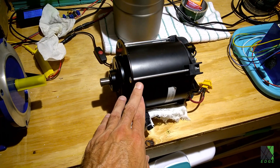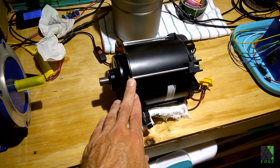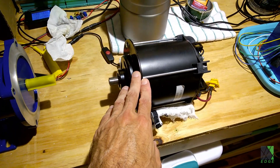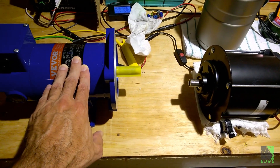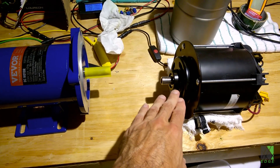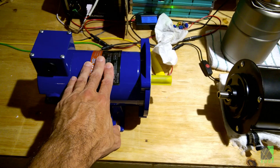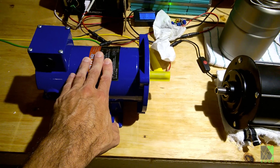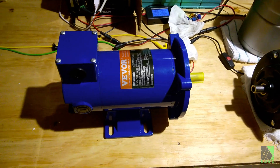This one is a half-horsepower motor. I did do a brief bench test and it jumped up and nearly landed on my feet on the concrete floor — thank god that didn't happen. This is a very powerful motor, and so is this one. What I could do — this is a high-voltage DC motor — is simply connect these two together, feed my solar panel into this, and I'll get plenty of DC right out of this motor. I can put a blocking diode in there instead of a bridge rectifier, and you could also use a smoothing capacitor to improve the charging.